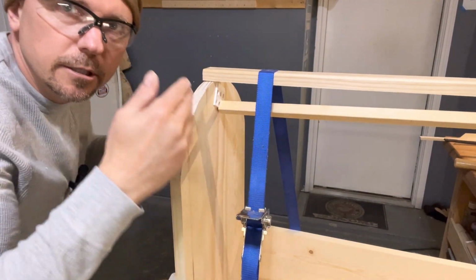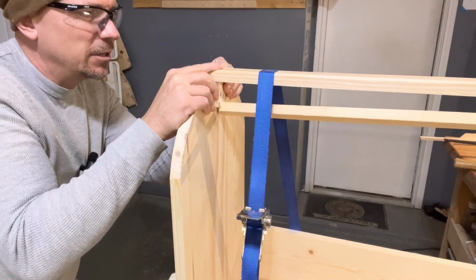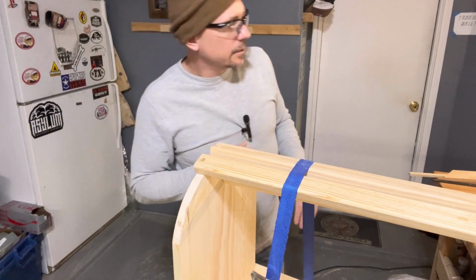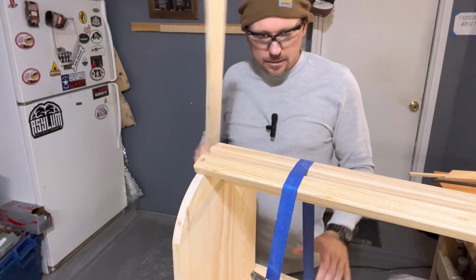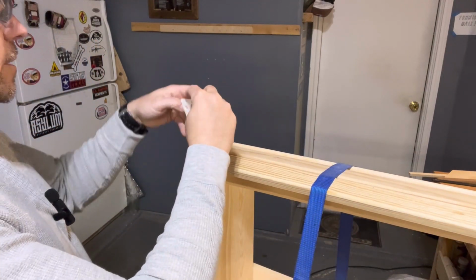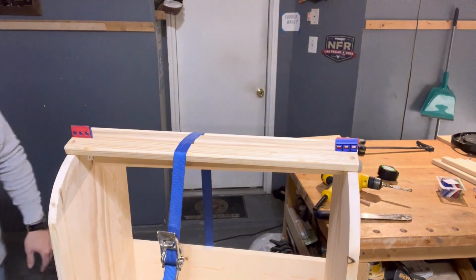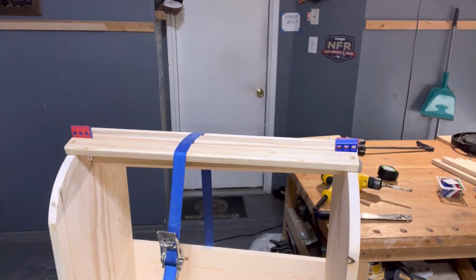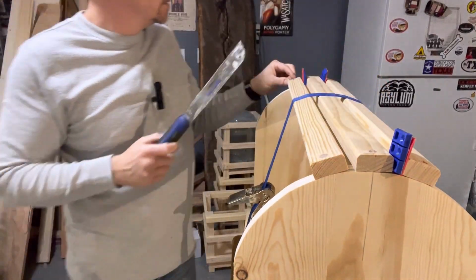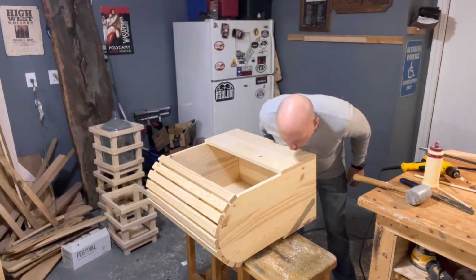I've got this little support in here to keep the width out, because you know wood tends to bow and move all kinds of ways. So I want to make sure that it's absolutely perfect. I'm excited. I wonder how many of these I can do at once. I talk about these little spacers so much I ain't even going to mention them. And that's going to give me my 5/16 spacing. After that, I just made sure all my holes were drilled, dowels were applied, and cut flat.